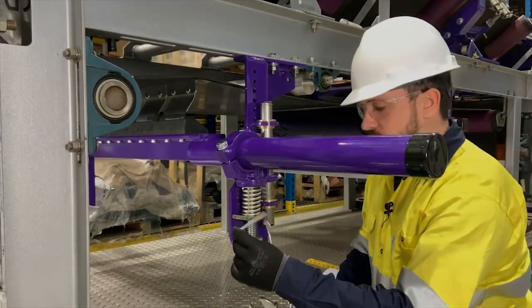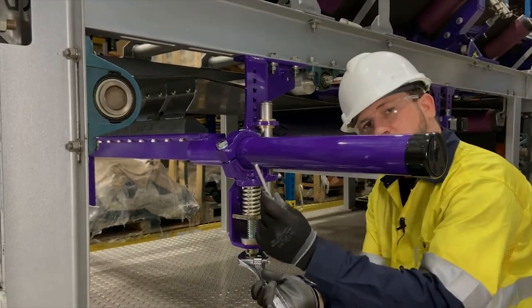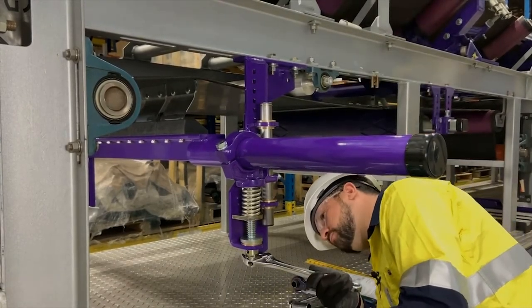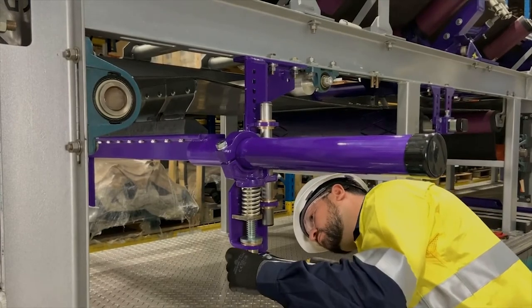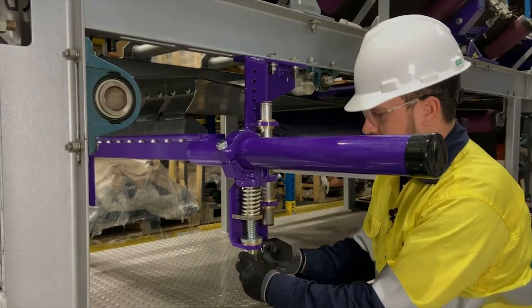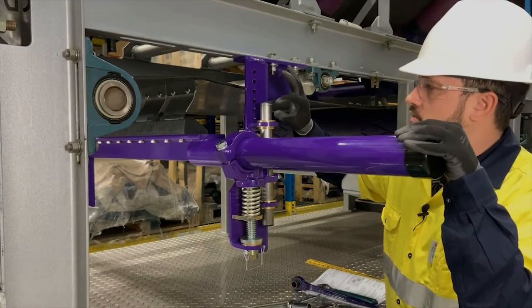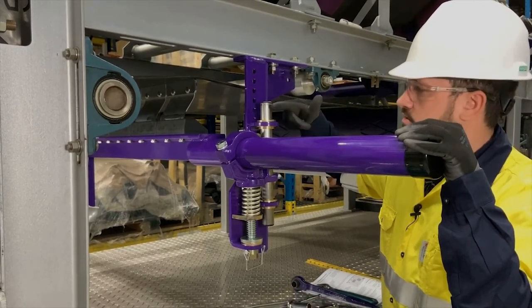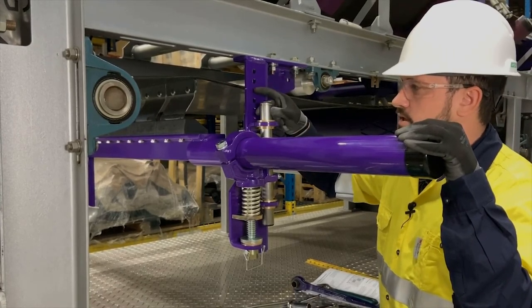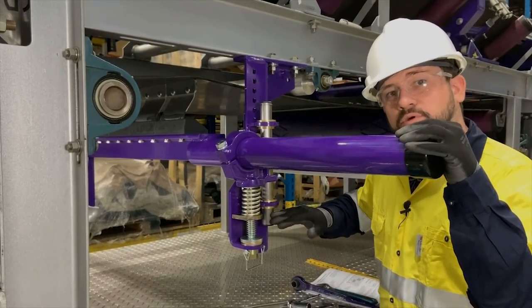Now what you're going to have to do is twist it just far enough that the pinhole will line back up, then reinsert the pin. Now you're set up and ready to go. One thing you want to note is you want to have at least a half inch above the top bushing exposed on the guide rod and at least a half inch below the bottom bushing.